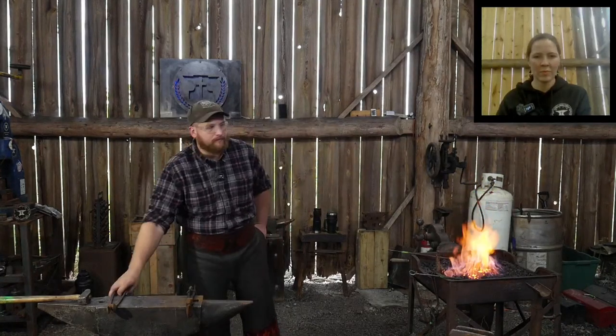They all start with the same basic principle of having basically a hunk of steel that you either carve, hammer in, punch, whatever you have to do to put whatever type of groove that you want into it, and then either weld on a hardy shank or forge that as one piece. So that would be my recommendation.